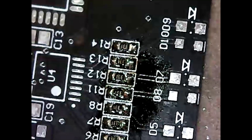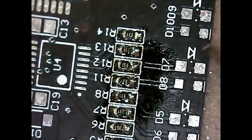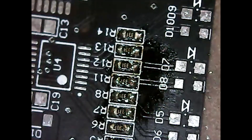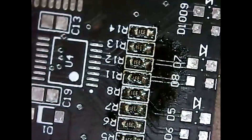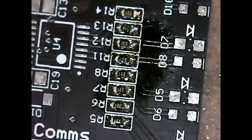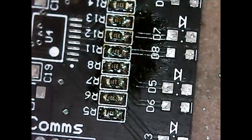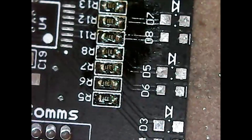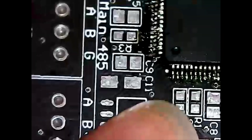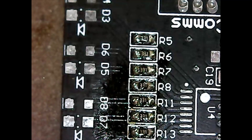See how they have a reflection to them — see how they're shiny? A shiny joint is good; a dull-looking joint is bad. Now all of my joints here are pretty shiny, so I know none of these have micro fractures or micro cracks in them. They also don't have gross crusty flux on the surface — that's kind of how you want your joints to look.